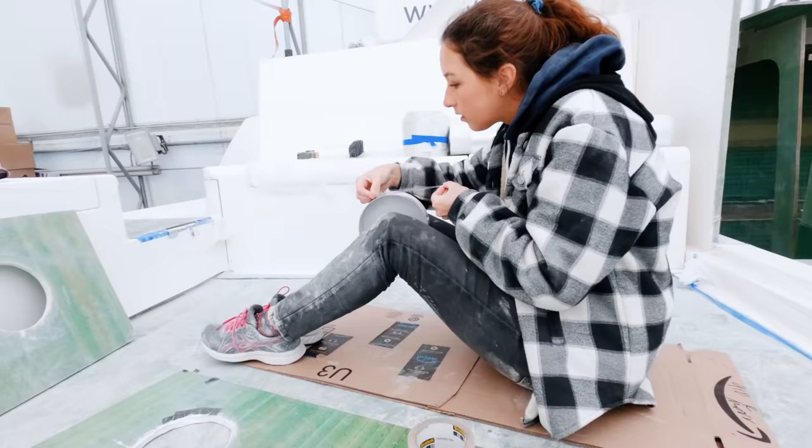Because we do still have that hole saw on loan from Vetus, I'm going to tape it up with some packing tape and then set it in the space and then backfill any of that gap with more filler. Hopefully I can just pop that out. I've got my perfect circle that I need. Maybe just a light sanding to smooth the surface down. Call it good. Tape it to your leg?